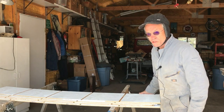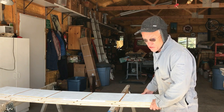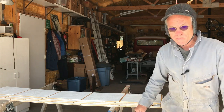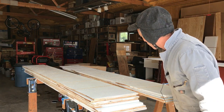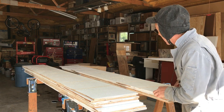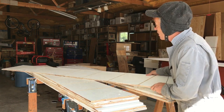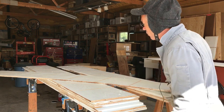I've made all the dado cuts in all the pieces of wood — 150 dado joints in all. These four pieces are the end pieces, the vertical ends to the shelves, and they are cut with a half-inch groove to accept the horizontal half-inch pieces. The half-inch horizontal pieces include top and bottom of shelves, cut on one side only, and the intermediate or middle shelves cut on both sides to accept the quarter-inch plywood vertical dividers.